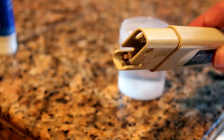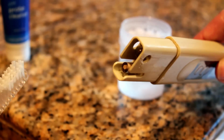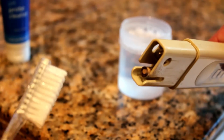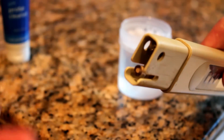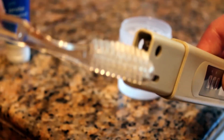Next we're going to take some of this probe cleaner and wipe down the little bulb and the wick. You can also use some detergent like you'd use to wash your dishes — just a very mild mix of water and Palm Olive or whatever you use. Never use your fingers to touch the wick, as that will destroy it from the oil on your fingers. Just take a toothbrush and gently scrub it down, nice and soft, and get off any excess nutrients or gunk that messes these things up.